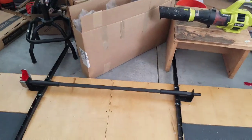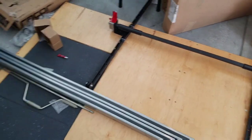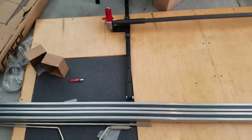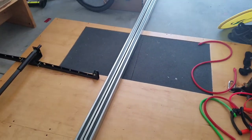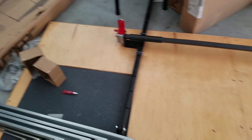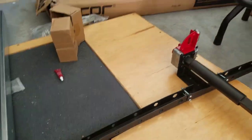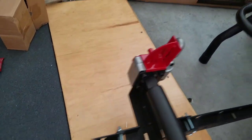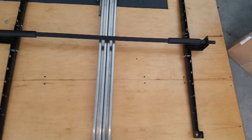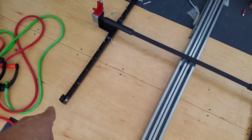The plan is to be able to use the lift, bring the Jeep top up, and then slide it into the loft for storage so that it doesn't have to hang permanently via straps. These rails are 12 feet long, going to get mounted on studs perpendicularly every 16 inches, and then I'm going to mount these rails that hold the pulleys in line.